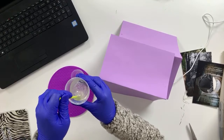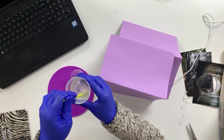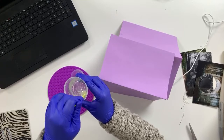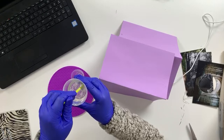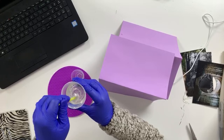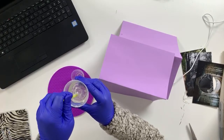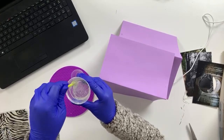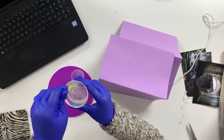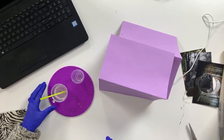When you begin to mix epoxy, it's really cloudy at first — that's the normal part of the chemical reaction, that's not unusual. Then it's going to get clearer when it's fully mixed together. I've got a few bubbles. I like to let my epoxy sit for a couple of minutes after I mix it — let it settle in before I use it if possible. I've got a fair amount of bubbles, but I'm not too worried about them.